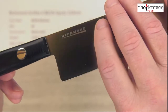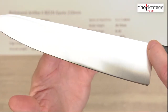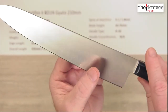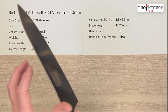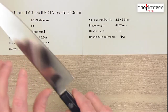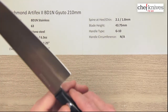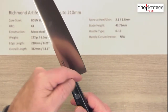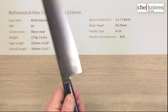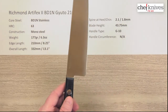You've got some etched 'Richmond' on there and vertical machine marks. Since it's not a clad knife, you're not going to see any cladding line. Nice fit and finish overall — they've got a fair amount of rounding to the spine and the choil edges. The choil though doesn't have much finish work, so it's a little sharp on the corners. You might want to take a strip of sandpaper to that — it's about a 10-minute job.